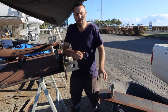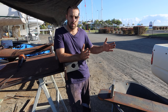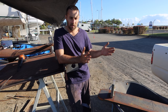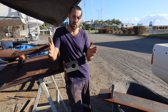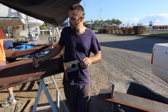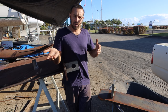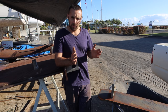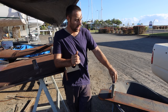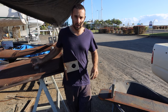When we built the wings I had to figure out how we were going to do thrust. Going forward, the wing's always going to try and move to the back of the boat. I set the wings and hinges up with two thrust bearings for the wing going forward. But going backwards, the wing would move to the front of the boat, and I was relying on the pins with the big stainless locking ring as the thrust for that direction - since you're not doing 10 knots in reverse. But I think I'm going to modify the doubler and move one of the hinges so I've got a thrust bearing in forward and one in reverse based on the stainless hinge, not the pin locking mechanism.